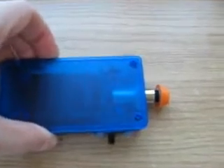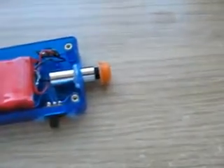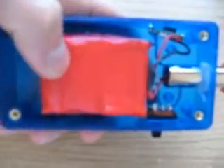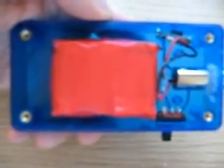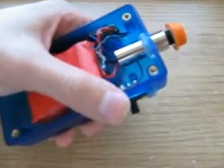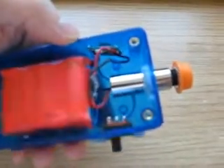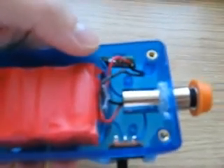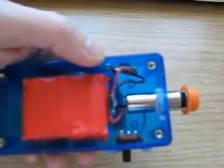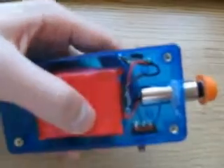I'm going to show you what I've done to host it in this project box. Here's my setup: 3 CR123A batteries putting out a total of 9 volts, connected to a simple sliding on/off switch, powered by the MicroDrive V3 laser diode driver.